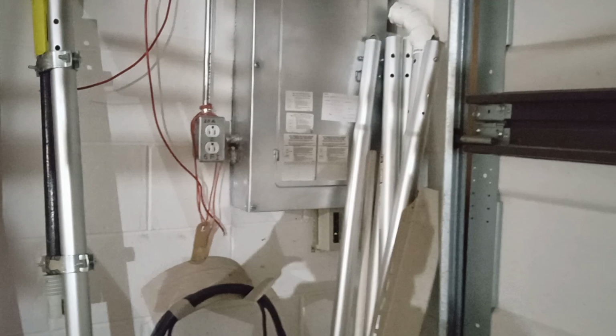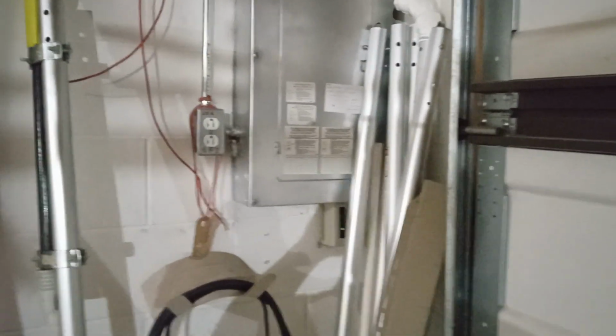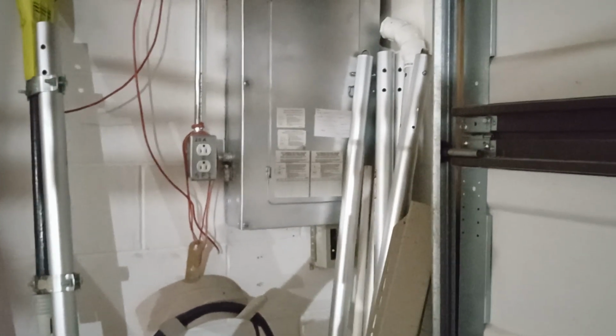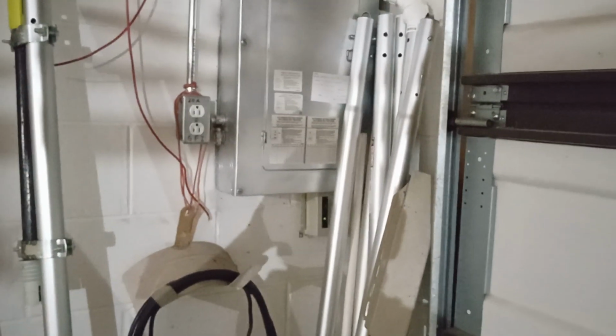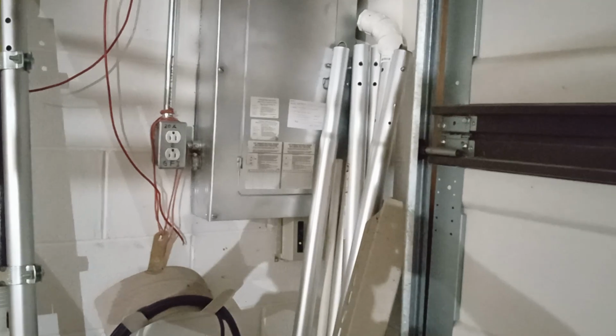And it's important to realize that the ground rod for this box has nothing directly to do with the load. It's about that corresponding ground that's out 75 feet out to the pole, and coupling those two together. That has protective benefits for the incoming service system. It has nothing to do with the load.